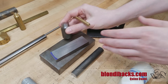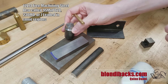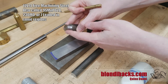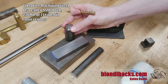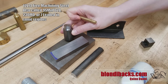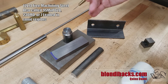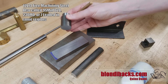If you're doing strictly machining, this is 12L14 steel — sometimes called leadloy or other trade names. It has a very small amount of lead in it that makes it machine very, very nicely. This stuff is really, really great, especially when you're learning — very forgiving. It's easy to get good surface finishes with it and it's going to build your confidence. I definitely recommend starting with 12L14. The only real disadvantage is that it's very difficult to weld — additives that make it easier to machine inevitably make it harder to weld.